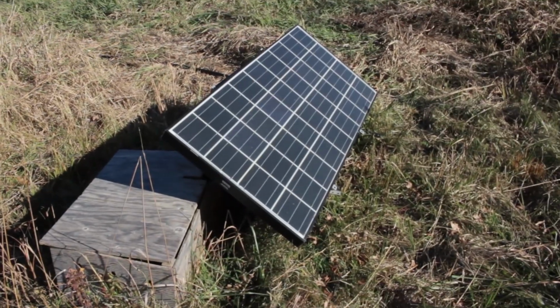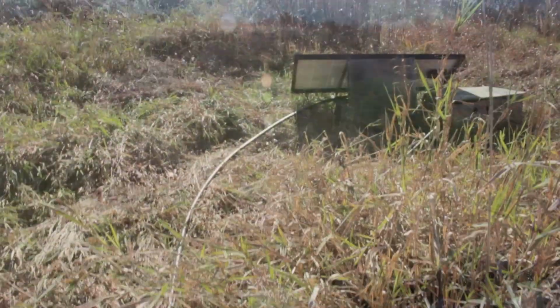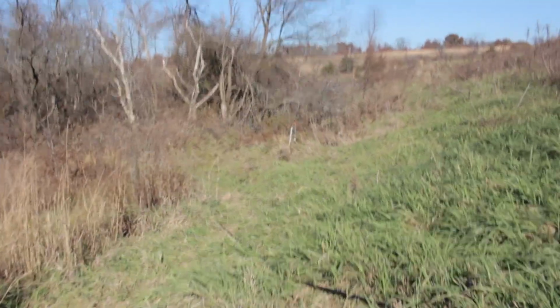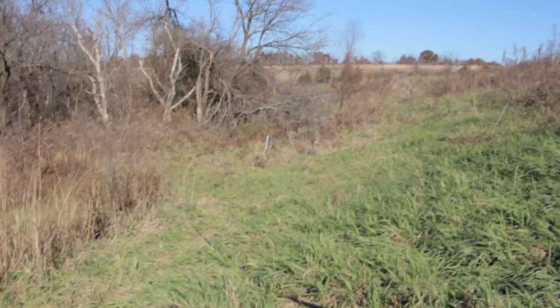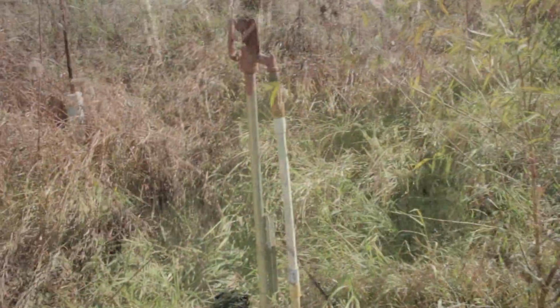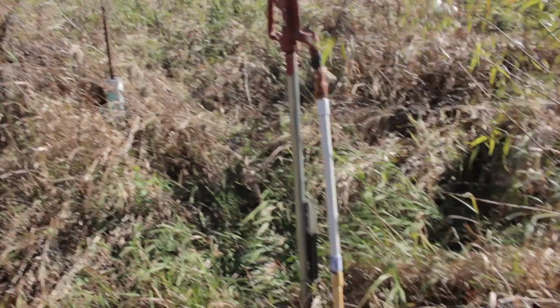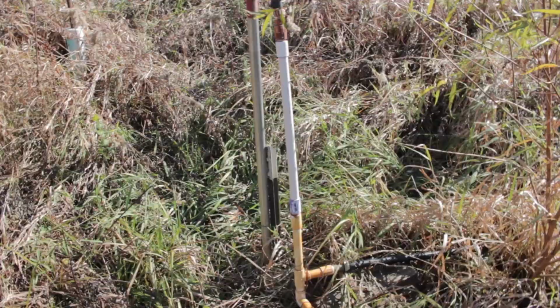Obviously in the hoop house, because it doesn't get any rain falling in the house, you need some source of irrigation. So this pipe goes all the way down to the hydrant, which has a pipe that goes through this dam, and so it takes water from below the surface, pretty far below the surface of that pond, so you're not going to get muck and other things sucked into the pipe. This hydrant is connected to a pipe and the shut-off valve is right there. It's connected to a pipe that goes through the dam and draws water from below the surface of the pond.